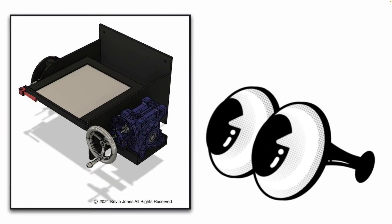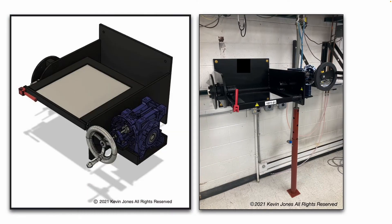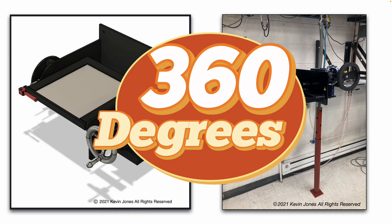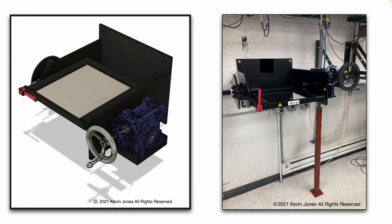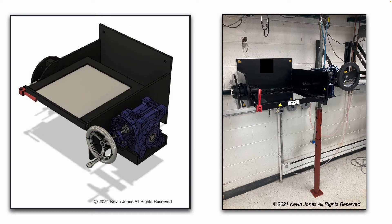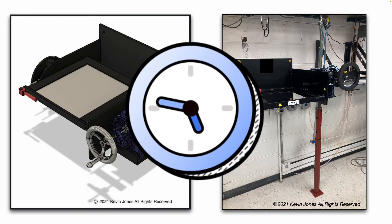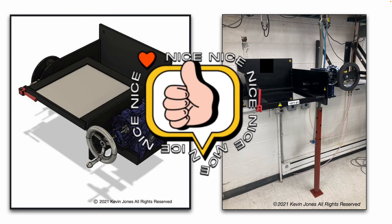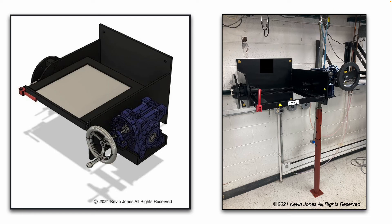Here is yet another metal fabrication product that I designed and built, shown here getting installed. Basically, there's a worm and wheel drive that you turn, and it rotates that platform 360 degrees. My current employer's pump technicians would bolt their pumps to this platform and be able to rotate the pumps upside down, sideways, right side up, etc. That greatly reduced the amount of labor and time, saved a lot of strain on employees, and helped them work more efficiently, productively, and safely. This got bolted directly to a concrete wall with reinforcement plates on the outside, and there's also a support stanchion that we added.